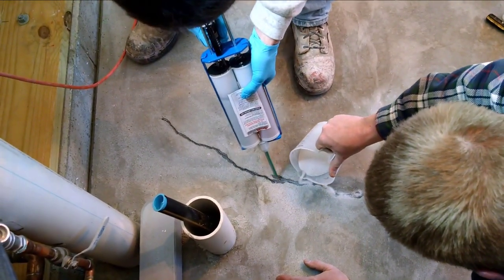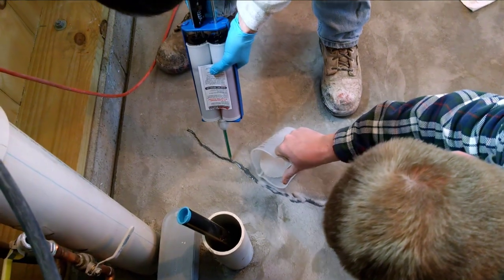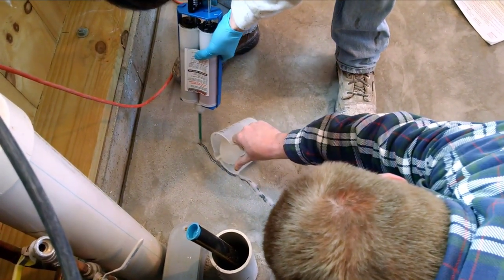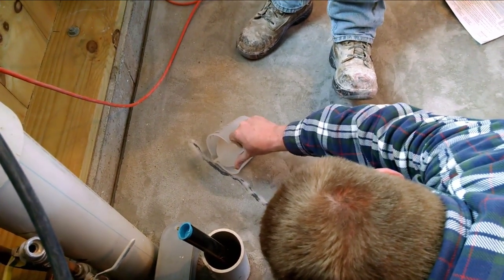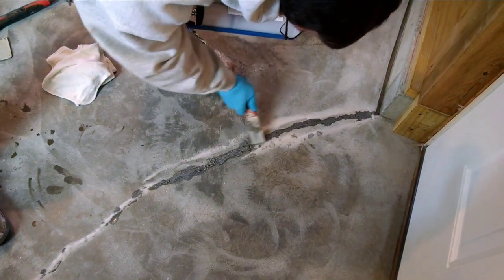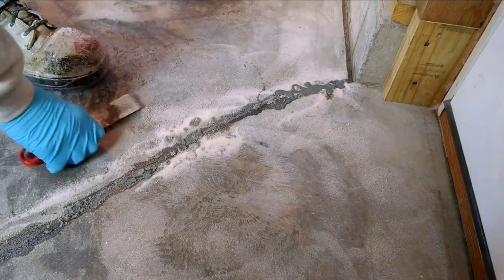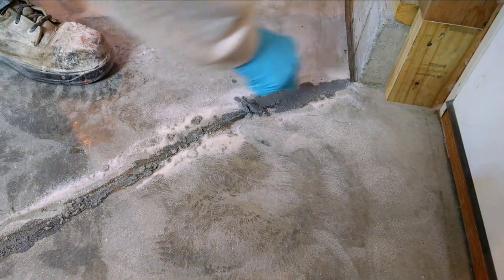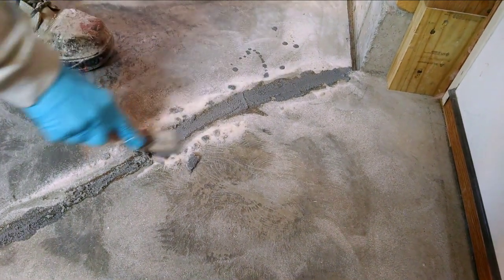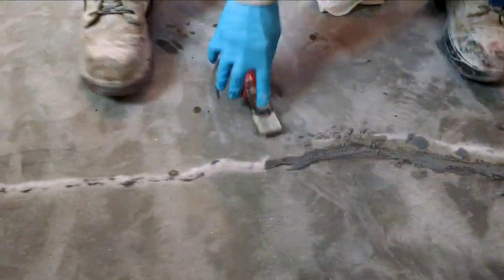You can see I'm wetting it out again and my other guy is adding the sand to it. You want to overfill it a little bit with the repair material. This is a two-part polyurea repair material — this stuff dries really hard and rigid. It's actually considered a structural repair. When it's all dry and done, it's actually stronger than the concrete — you're kind of welding the crack back together. Force the sand down in there, making a putty with some extra material. If you need a little more, just squirt a little more down. Leave it overfilled — you're not going to want to try to scrape it perfect on this first run.